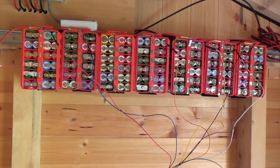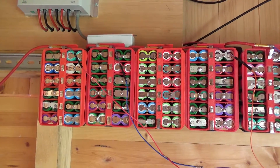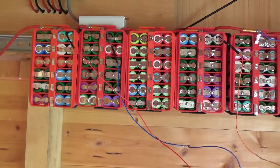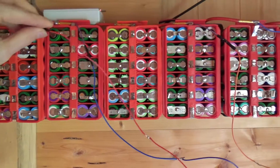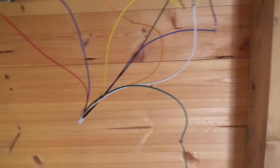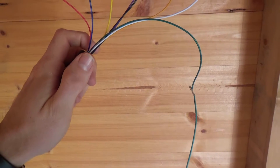I've got the seven battery packs all done and I've completely ripped off Paul Kennett's design - I'll make absolutely no qualms about that. It's fantastic, really modular - you can swap the packs in and out. I picked up some DIN rail and used DIN rail mounts, it's absolutely brilliant. I've also gone down to using the Dupont style connectors, the same as his design, so you can just plug in the BMS monitoring cable to check how in sync the pack is.